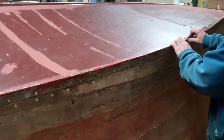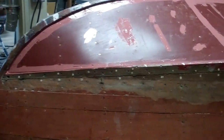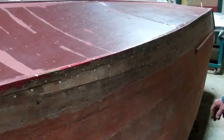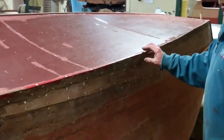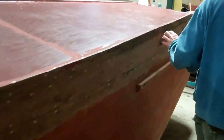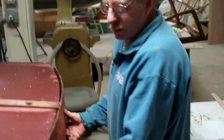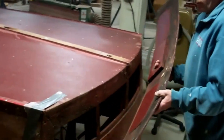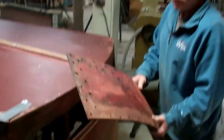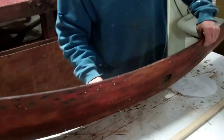And we have spoken and come to an agreement with Wes Van Dyne, the owner of this Gar Wood, that these two planks just simply must be released on both sides. We started releasing the transom plank. We took all the screws out last night and released the transom plank so that we can embed it with 5200, but unfortunately the transom plank is in pretty rough condition, so we'll probably replace the transom plank.